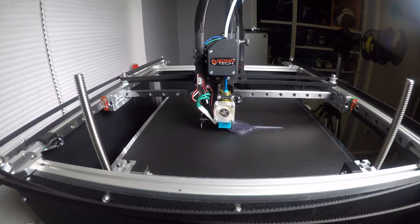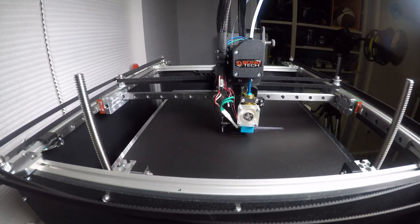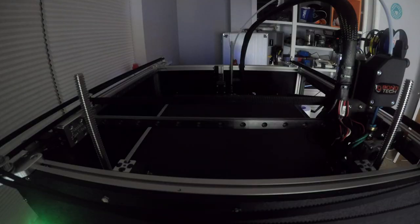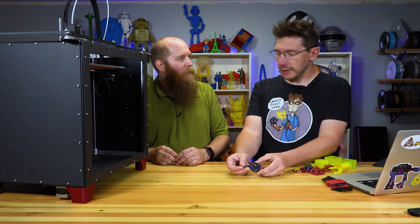At 0.02mm you're laying down so little plastic it's almost wizardry. And other machines that can print really low layer heights can't do it at these speeds. That's a function of the fact that the bed is supremely, truly level. Here's also a Sierpinski's triangle, printed at 75mm/s as well. It does slow down slightly at the very top because it needs time for cooling — but that's the only reason it slows down.